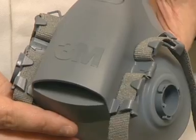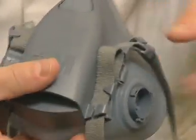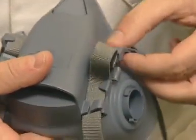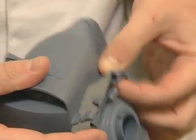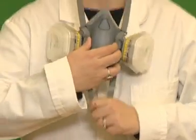If you prefer to use your 7500 respirator in the optional drop-down suspension mode, before fitting slacken the straps and bring the loop created in front of the tab with the arrow. Place the cradle over the crown of your head, then holding the straps in one hand, slide the face piece up onto your face.